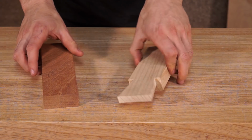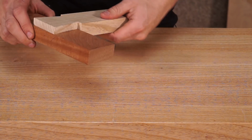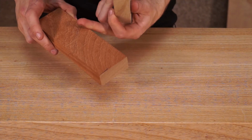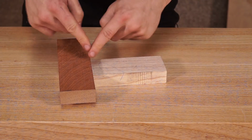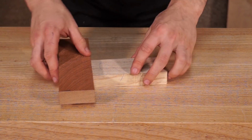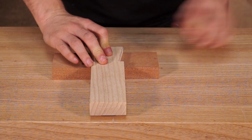Now let's get it cut out into this. So face side is up on here. Don't be tempted to cut into your face side, because obviously that would mean your face side's up on here and your face side's down on here. Keep track of them. Remember, they went up this way in the shape that wasn't a heart, so we want to be doing that. So flip it over like this, and we're going to trace around this with a knife.